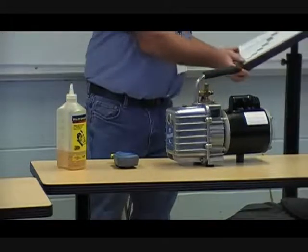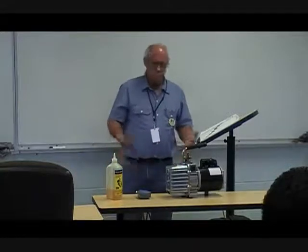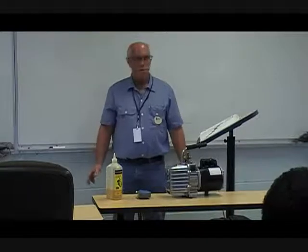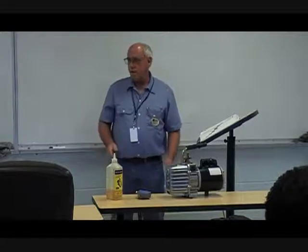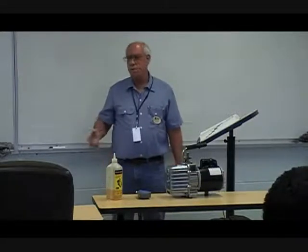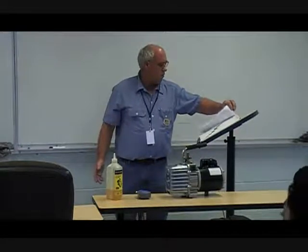Let's talk about other contaminants. If you've got air in the system, you've got moisture — that's all there is to it. You might ask how you could have moisture, but I guarantee any air left in the system is going to have moisture. We're not talking about large amounts — not something you're going to be able to see. We're talking about molecules of moisture in vapor form. Don't think of a glass of water; think of it in vapor form.